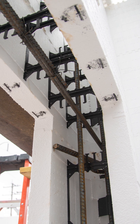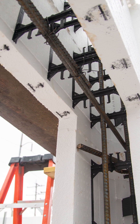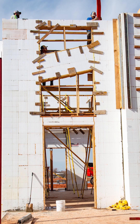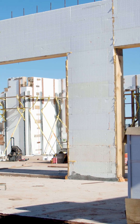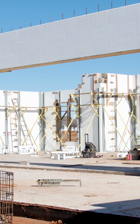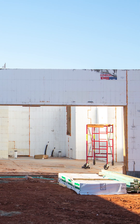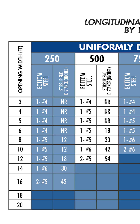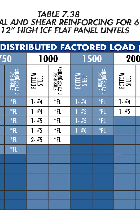In masonry or concrete, what we call a lintel is the spot that goes over our doors and windows — there's always extra steel to carry that opening and run those spans. Depending on how wide that is, if you reference an 18-foot garage door, you can go to those tables, see what that span is, and see what your core thickness is.